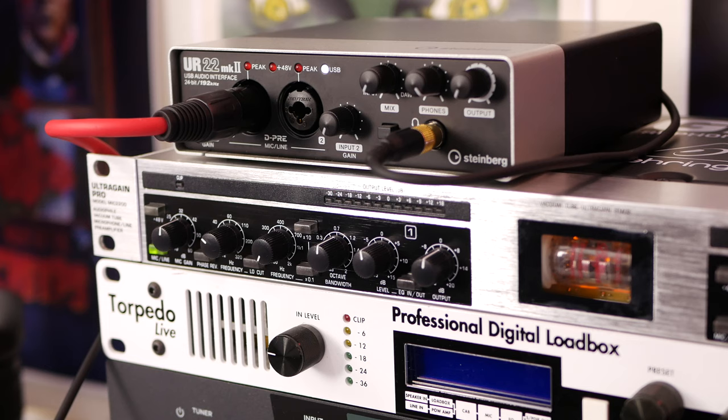The setup you're hearing right now is simply the microphone going straight into the preamp. I'm not pushing either of them very hard, but there's more than enough audio signal — I can boost that in post, or simply crank up the output on the sound card or on the Ultra Gain Pro itself. I like to keep levels pretty safe and adjust in post, so if I speak loudly it's not going to distort. It didn't distort. That's how I like to run it.